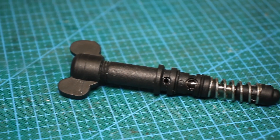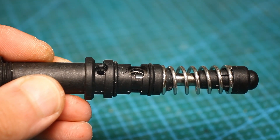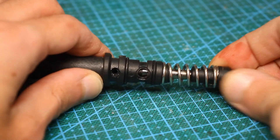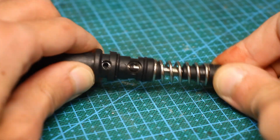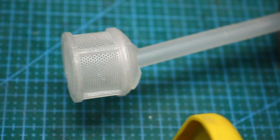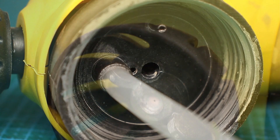This part is a piston on which the electromagnet presses. The piston is made in a simple way — there is a return spring and a tube with two holes inside which the piston moves. By making a reciprocating motion due to the electromagnet, the piston through the first hole injects pressure into the reservoir. Due to this, the paint rises through the tube to the second hole, from where the paint is sucked up and then sprayed.